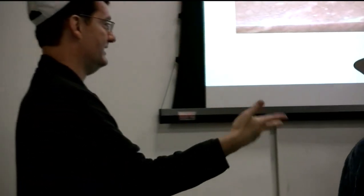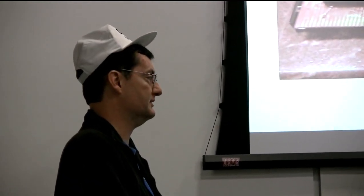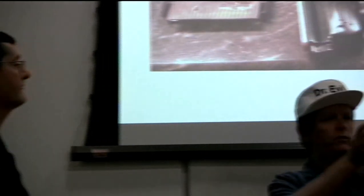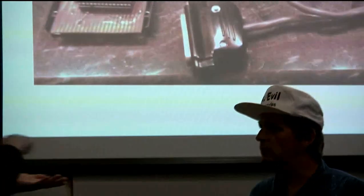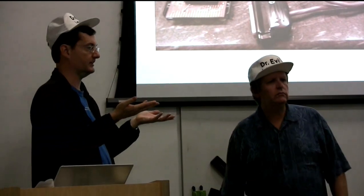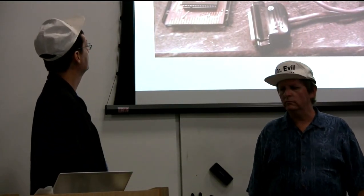Those special plastic sheets had just come on the market - no project is an island. That made prototyping really affordable because before it was awfully expensive, or you had to breadboard it - which is hard to fit into a cartridge. The cartridge connector fingers had to be exactly the right dimensions. Every time you made one you got another surprise about which traces didn't glue down. You'd make two or three and choose the least-worst, fixing it up with the pen.